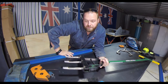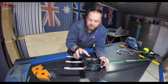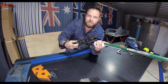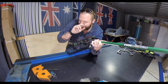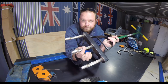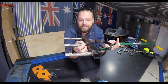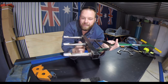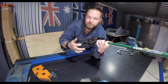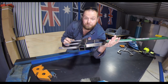You'd stab the lawn with it and it would take a core out. Then when you'd go again, the tine would be full and it wouldn't eject out the top like it was supposed to — it would just start compacting instead. So I bought some replacement tines off the internet, for an actual lawn aerator. They have a shaft that runs up through them, so I just drilled the holes out and plug welded them in. Works really well.